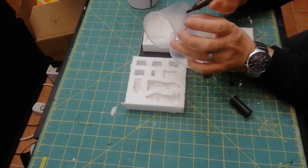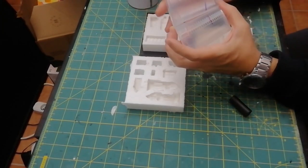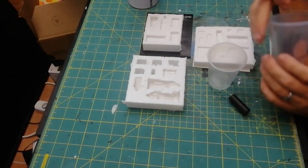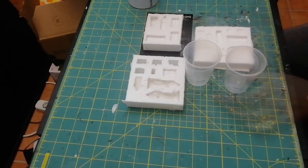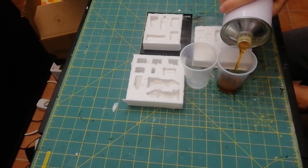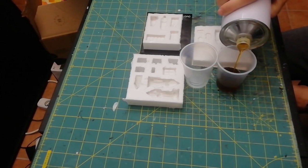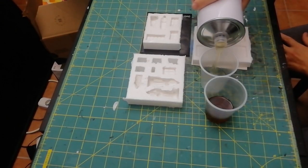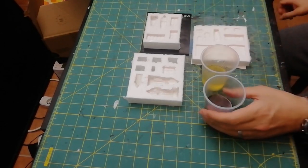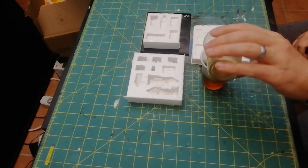Also in this case, although you have seen me dozens of times weigh my resin to obtain the 1-to-1 ratio, a method that considers the volume ratio better and not that of the weight is to simply make notches on your plastic cup. Here too, always take your time to mix the two components well, doing it firmly but avoiding creating bubbles or foam during mixing.